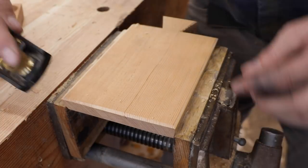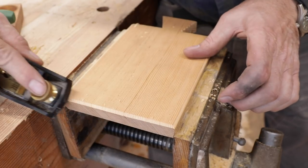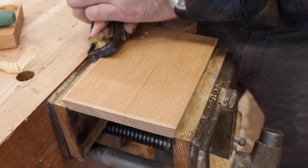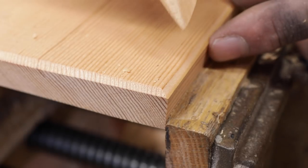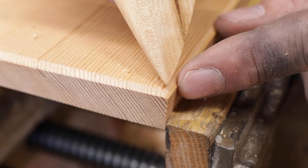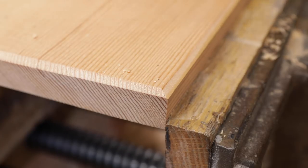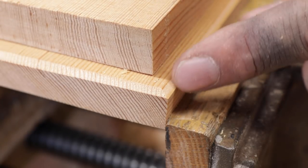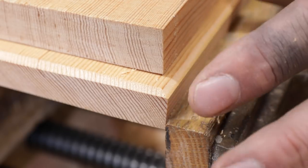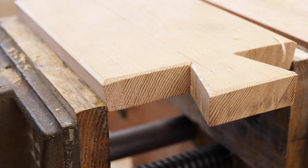It's so small but it's everything. The same thing over here — just till they come together. We're a little bit shallow right there on the end grain so we want to come in. It's not perfect, that's okay. Oh yeah, that is nice right there — you can see that little detail, just changing things up, having multiple angles and facets that create shadows. That is everything in aesthetics and design, contrasted with just a square piece. The difference is subtle — you may not even notice it at first, but to the touch, the holding of it, and the way it reflects light just makes it so much more interesting.